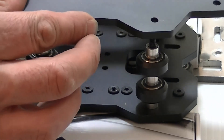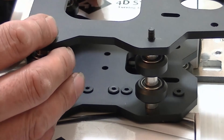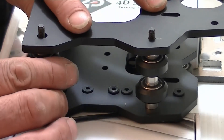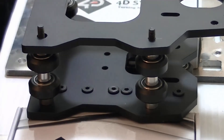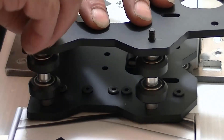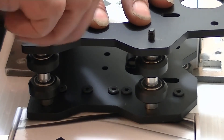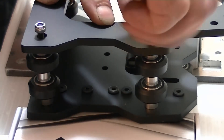Glad I spotted that one before I put it on the machine. Take it apart again and face them downwards before trying to put your plate on top, so it's nicely lined up. Got the back of your X carriage on. And again, we'll put some M5 Nylocks on — gone for chrome on the back because you can't see them. Not being a cheapskate — I'm running out of the black ones and I need them for the sides.